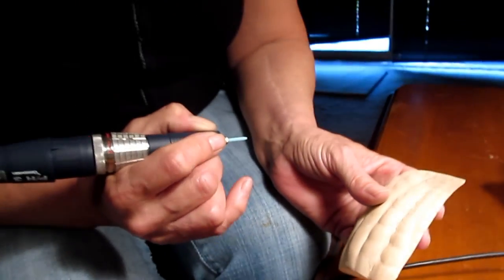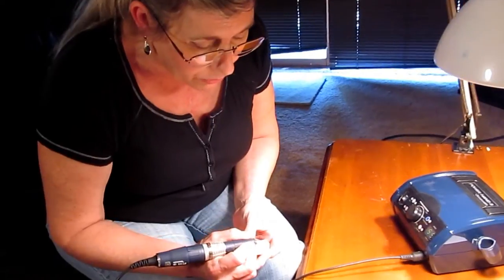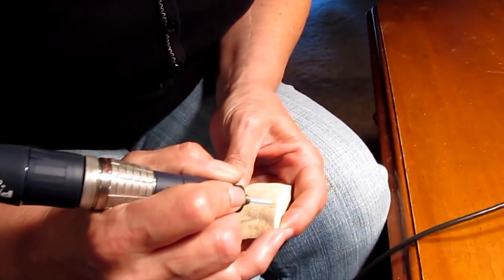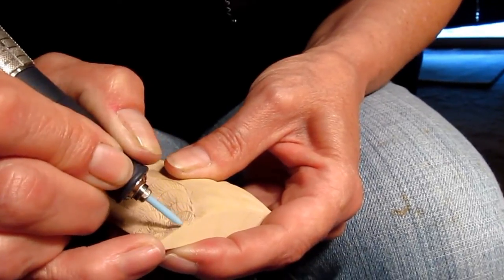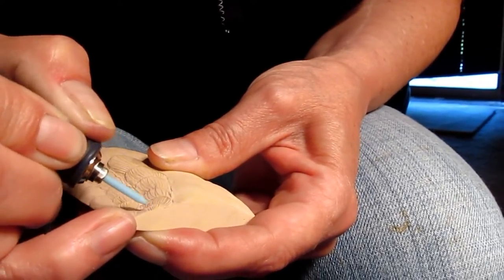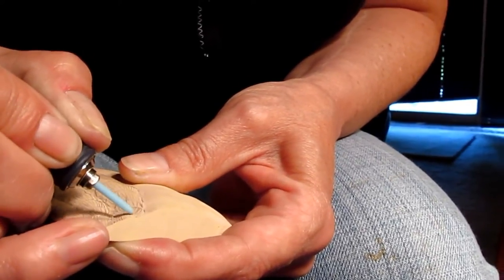I've penciled on individual barbed lines to give you some guidance as I'm texturing, so I don't have to worry about the feather flow as much as I am worried about the quality of the strokes I'm creating with the texturing stones. I create the texture on the topmost feather first because it defines what I'm going to be doing with the feather below it. Using a light which is going to cast a shadow allows me to see my work as I'm going along. Without careful strokes, you can find yourself going over the same place several times, only to create a deeper cavern than you were really intending.